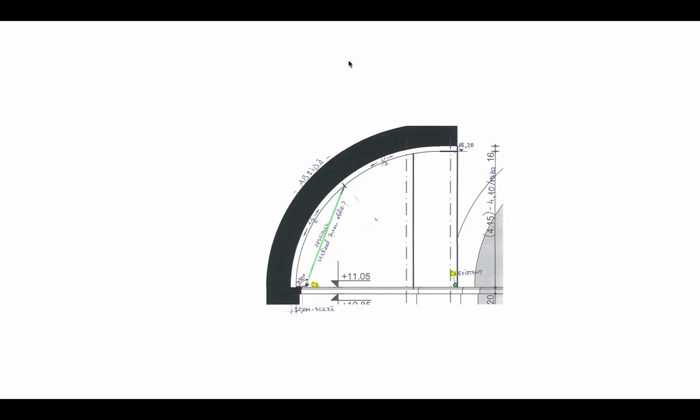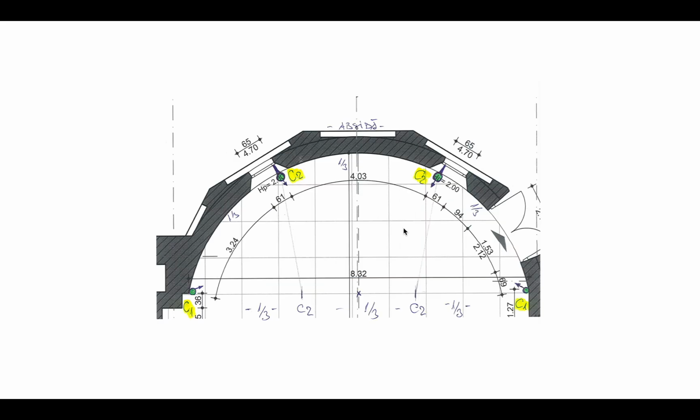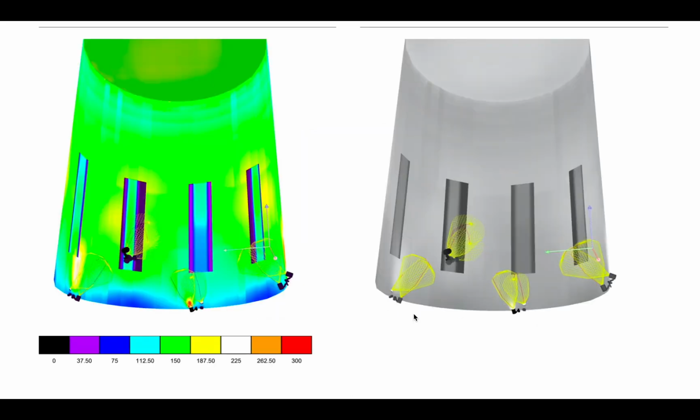And moving on, also the drawing, we have a longitudinal view. Here 1 luminaire was installed. You see from each height it was installed, and here we have the top. So as I said, 4.15 meters, and this is the layout from a view from the top. So I installed 4 luminaires, which divided the space in thirds, and orientated them.